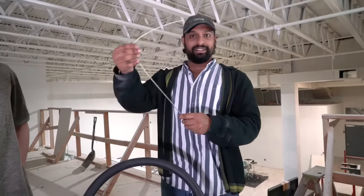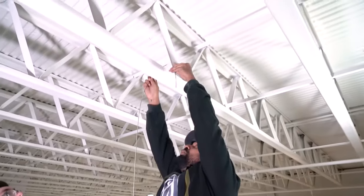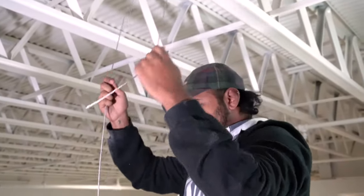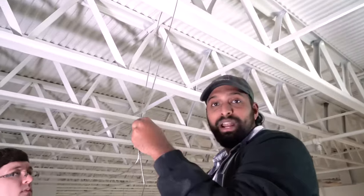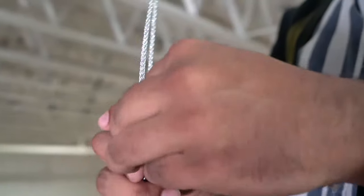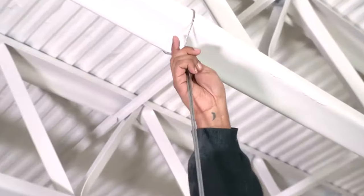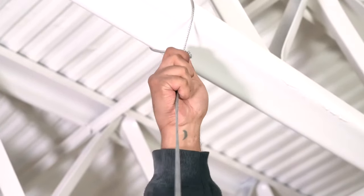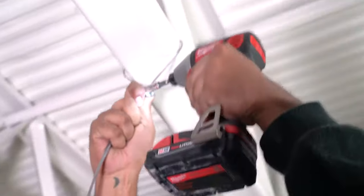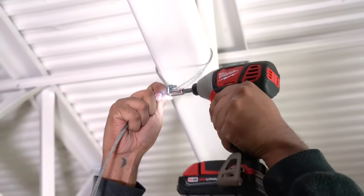The first thing we're going to do is take our stainless steel cable and hook it over the bar. I'm going to loop it all the way over and find a nice place to hang it — I want a little bit of slack so I'll keep it right about there. Then take your cable clip, run the cable through one side and then the other side through it as well. Once the clip is on, run it all the way up — you can see how it's tightening that connection and making a really strong loop. That's firm — I could literally hang on this wire if I needed to. Now take your screw gun and tighten both of these nuts.